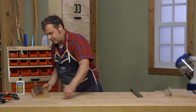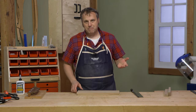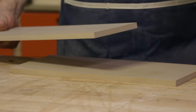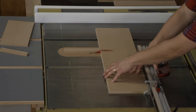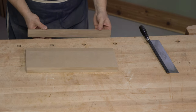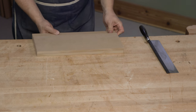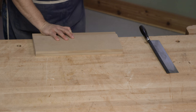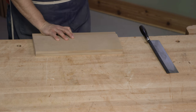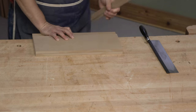To change this to use with a western cutting saw, I'm making the base out of two layers of half-inch MDF — a really low-cost material that is flat, stable, and easy to cut. I cut these at the table saw and then cut them to final length. The reason I'm going with two layers is that on the front edge I want to add a cleat that hooks into the bottom of the miter box and acts like a bench hook, registering against the front edge of the workbench to oppose my cutting action, so it stays in place without clamps. I also cut a fence that will get set into grooves in a little while.